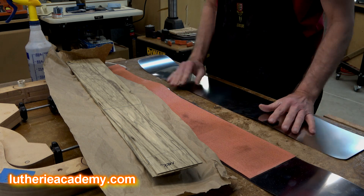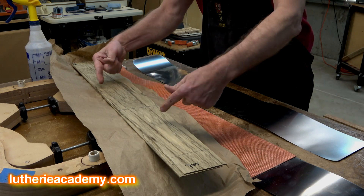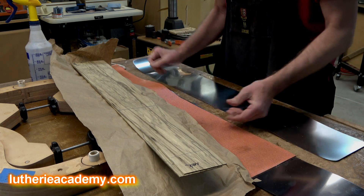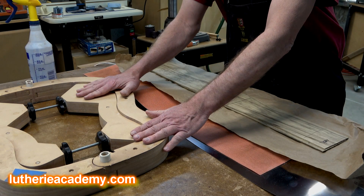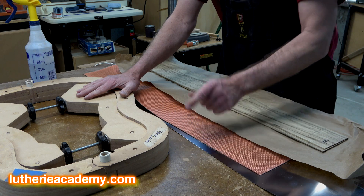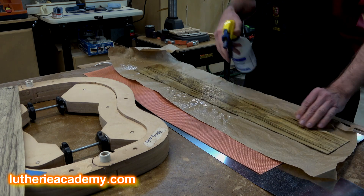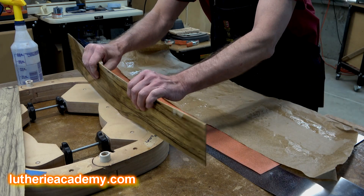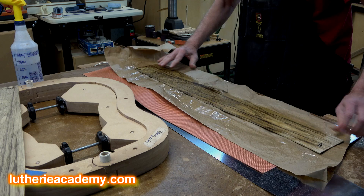The first thing I'm going to do is build a sandwich, as we like to refer to it. That's a piece of spring steel. Then I put the side that's been spritzed inside some paper, then another piece of spring steel on top of that, then a blanket, and spring steel on top of that. It's very easy to get two left sides or two right sides, so I like to put my form on the bench in the same direction as my bending machine. I've already thicknessed and profiled my sides, and I notice that my waist needs to be bent this way, so that's the way I'm going to put it into the bender.